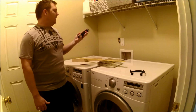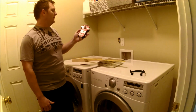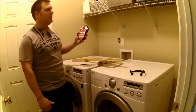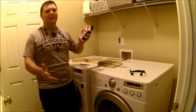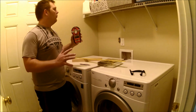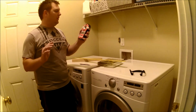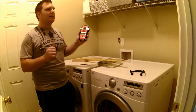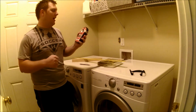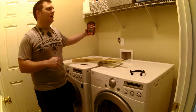I like this one a lot because a laser level is included, like you saw me using. But I've had mixed luck using these. Maybe it's just because I'm not a seasoned carpenter or whatever. But I get a lot of false positives with these. They do work, but I've had so many times where I think I found the stud and I drill in and there's not a stud there, that I like using the magnet just because it's almost certain.